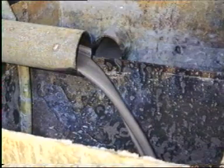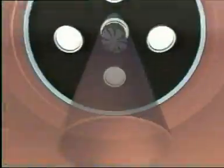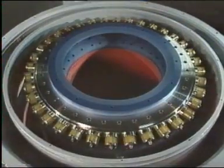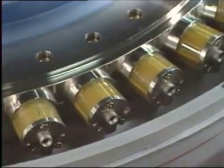The Falcon C is mainly used for pre-concentration or scavenging of final tailings. It works similarly to the SB model: a spinning bowl where feed is introduced through a center feed pipe to the base of the bowl. At the base, the impeller accelerates particles to the side walls, and material moves up into a collection zone containing a launder or a range of hoppers linked to valves around the perimeter. These valves are set at a certain aperture size controlled by air pressure, allowing a set amount of concentrate to pass through to the concentrate launder on a continuous basis.